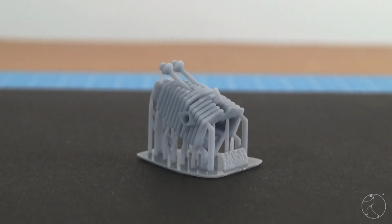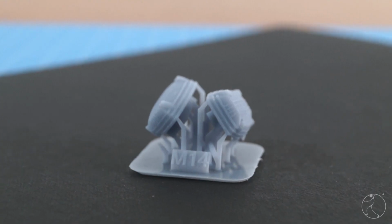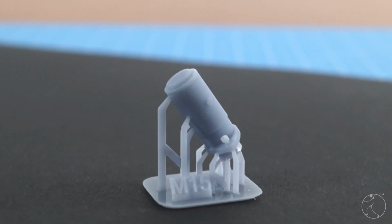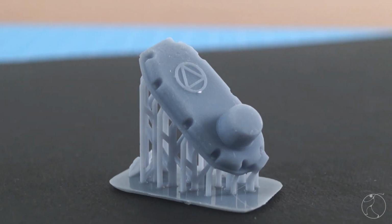The platform stuck together a little. When assembling, we will see if there is an error. If the grooves of the parts are connected with difficulty, then we need to set the exposure time even less. But there is no less. In this case, everything will just fall off, or we increase the distance in the grooves.